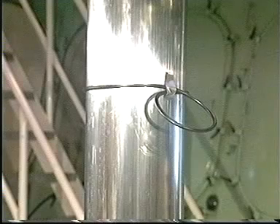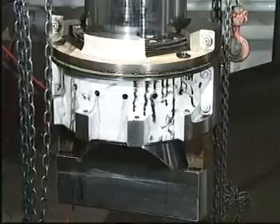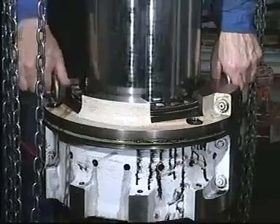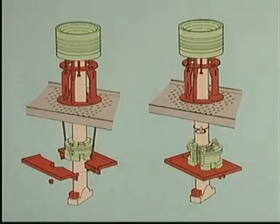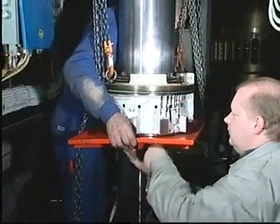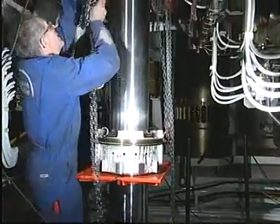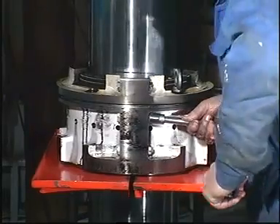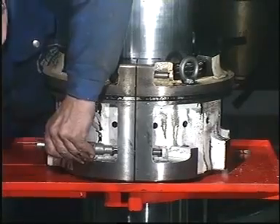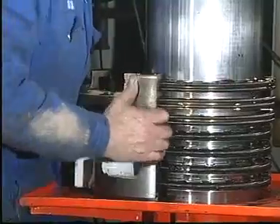Before starting the overhaul, tape a new o-ring to the piston rod above the stuffing box housing. Insert lifting eye bolts and lift the stuffing box to a comfortable working height. Mount the work table around the piston rod. Remove and discard the o-ring. Loosen and remove the assembling bolts and the fitted bolts. Remove the stuffing box halves. Do not use a chisel to separate the halves as this will damage the contact faces.